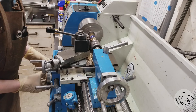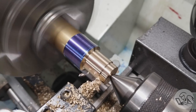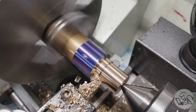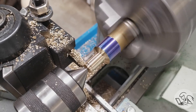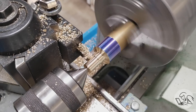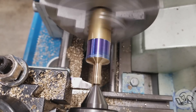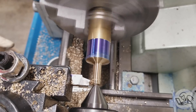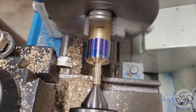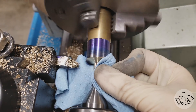Because brass is so easy to turn — even with a generous nose radius and fairly high tool pressure, this is practically a form tool — I can still do hundred-thou passes with no trouble at all. Then once I crank up the speed and crank down the feed for the finishing pass I can get a very fine finish indeed. I've got the tool mounted square in the tool post and I'm using the lead angle to create a nice bevel on the underside of the knob. That's functional: when the knob is tightened all the way in, there's clearance for your fingers between the knob and the milling machine table.